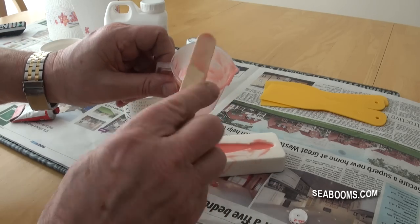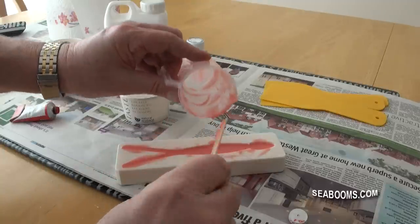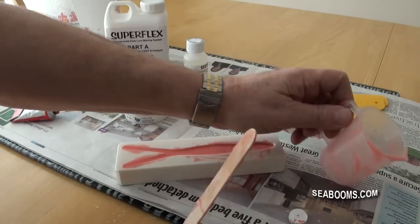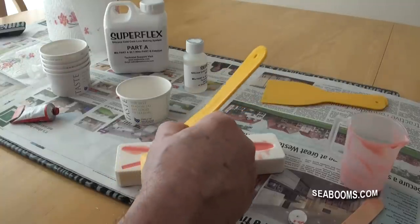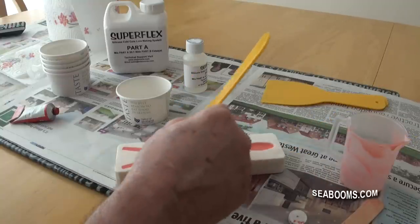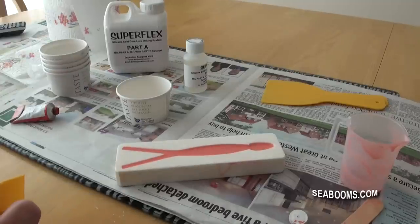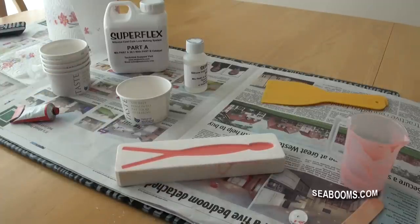Keep the pour just back from where it's filling so it pushes any large air pockets out of the mold. Scrape all the contents out — don't waste any. For material that's run around the edges, get one of your scrapers and work it along, filling that back into the mold itself. You don't need to overfill it. There we are — nice clean edges, quite simple, no waste. That's now ready to set. Leave it for a couple of hours at room temperature and it's ready to demold.